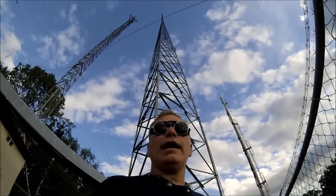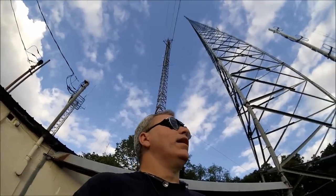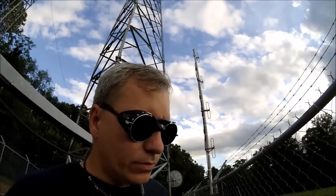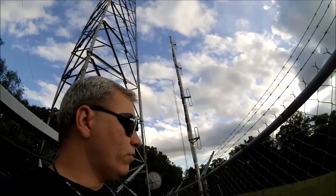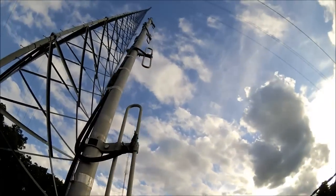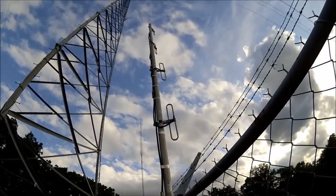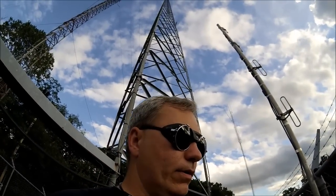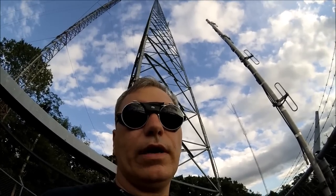We got the hardline unloaded and now we're ready to go inside and check out the MMDVM repeater. The transmit antenna is probably going to be this antenna right here — if you can see it, this one right here. It's just a little folded dipole, only a four-bay, not a very big antenna. But it's big enough — it should do the trick. If we can get it up there on that tower it'd work even better, but it'll work pretty good here on the ground for right now until I get the hardline pulled up the tower.